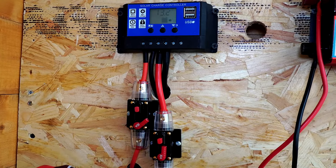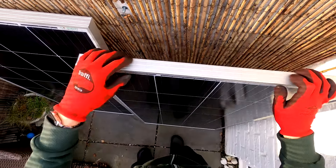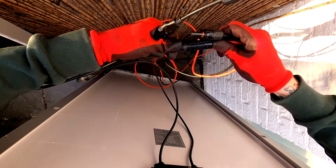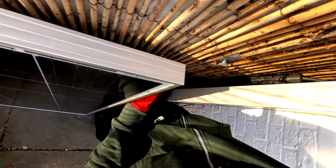Now I'm simply pushing the switch on the breaker which creates the circuit. Now you see power from the battery to the charge controller. Then I'm going to connect my positive and negative cables back into my solar panels and show you how I hang these solar panels on the wall by two bolts either side. By using the branch adapter, this allows these cables to stay in a parallel setup which will keep this at 12 volt. When connecting these in series, the voltage will then be added together.